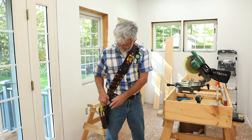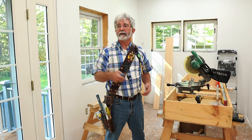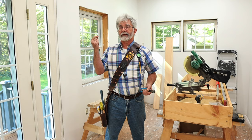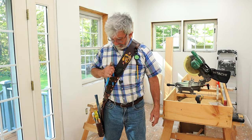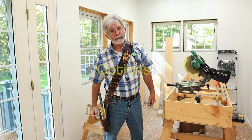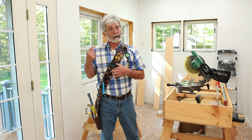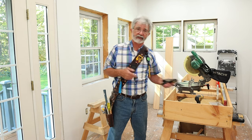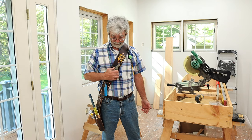Here's the sweetheart corner rounder tool — I've sharpened it for trim work — and it could slide into a slot here. I may need diagonal cutters while trimming these windows; if a 16-gauge trim nail doesn't go in all the way I might have to snip it off, then use the nail set to drive it home. I have leather loops here I can put handled tools into. There's also a tighter loop down below. This is kind of a modular tool belt — there are options. And this Holstery magnet right here is amazing — almost too powerful.